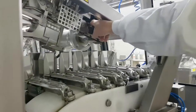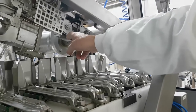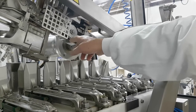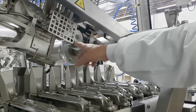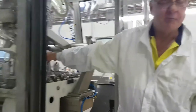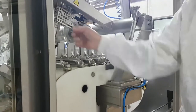If we have a badly worn belt, you don't shim a bad belt. You replace the belt with a new belt, and then you do not have to shim. Because some people don't want to spend money on a new belt, they re-shim. Replace the old belt. Don't re-shim.